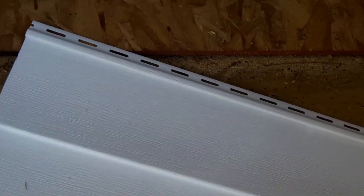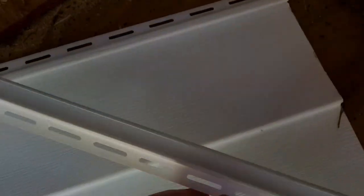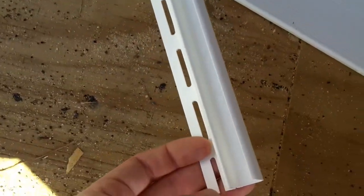That's basically it for the siding and where it sticks into. You have to cut different pieces around your windows and doors, and I'll show you what I did there. There are also little runners for the soffit — instead of having a pocket that faces down, they face out, because the soffit runs from the side of your wall to your fascia board. It sits in this pocket here, and I'll climb up on a ladder and show you where we did some of that.